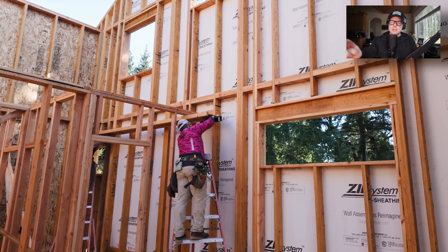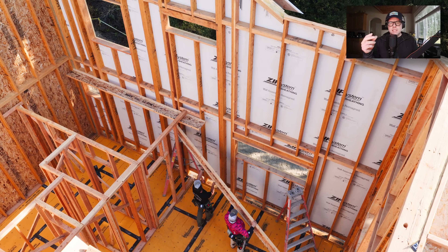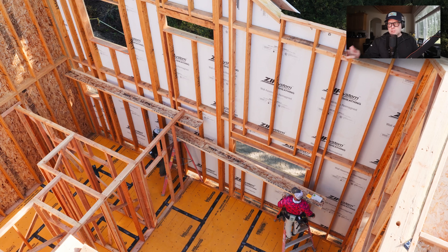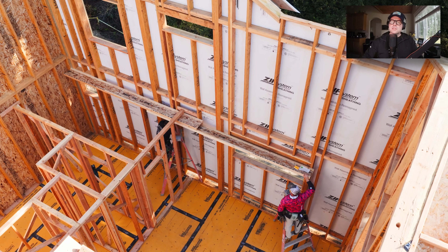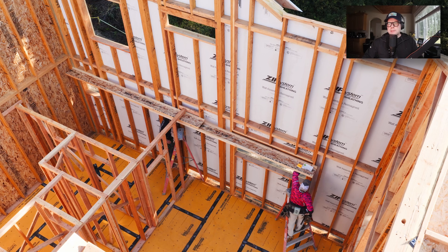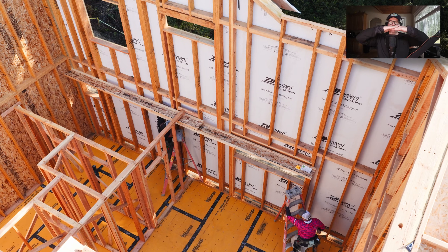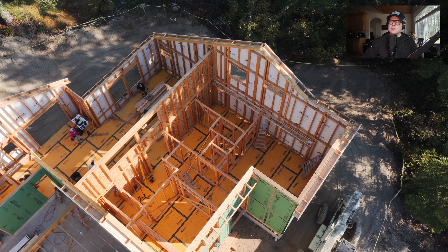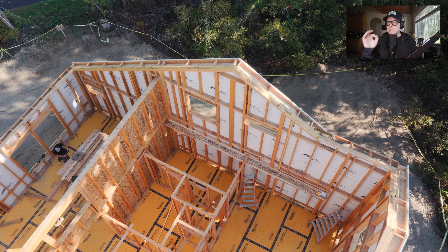They're nice and lightweight and super straight. You could do this with a nine-and-a-half inch I-joist. Typically we'll put a screw on each end and then in the middle — if everything's nice and tight to that I-joist, good enough. They can get a little squirrely with Doug fir studs, so we'll go every one, if not every other. We're using two pieces with a nice healthy overlap — I want to overlap at least two joist bays. That just seems like we're more likely to get nice and laser straight. This is extremely important because our floor system is going to be our diaphragm and I want that to be just perfect.